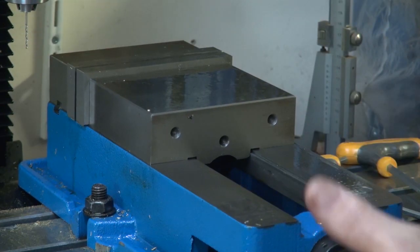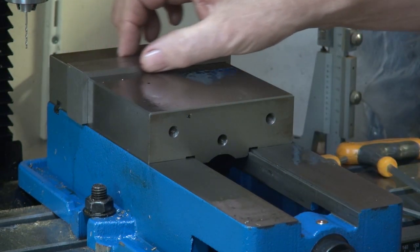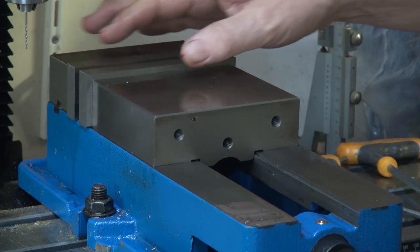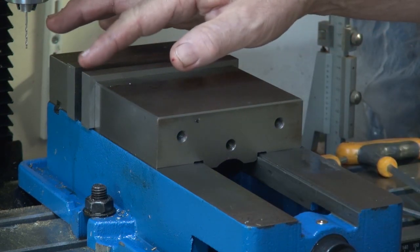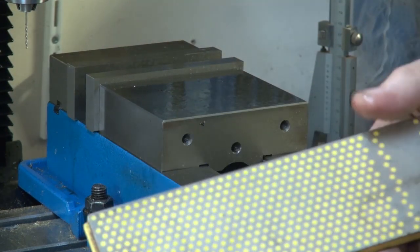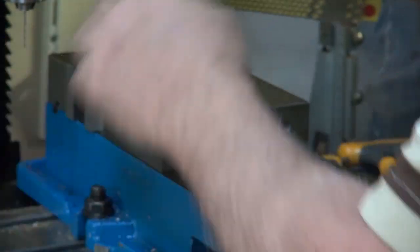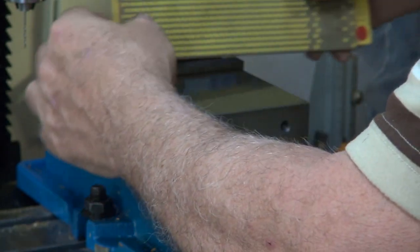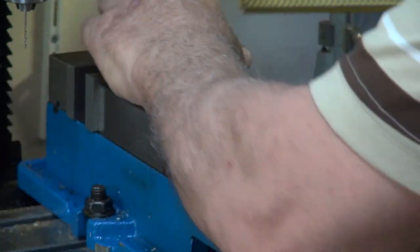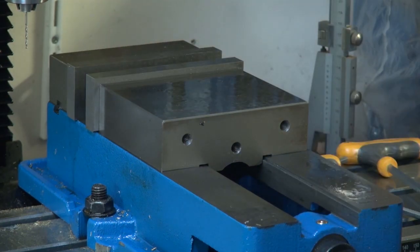These vices are very heavy. One thing to look out for — and it really is a compliment — the edges on the vise jaws are so sharp. I don't think they need to be sharp on the outside. The inside edges, yeah, I'm keeping those sharp. But the outside edges I'm just giving a couple of rubs with a diamond stone to take that very sharp edge off. You'll want them sharp on the inside for accuracy.